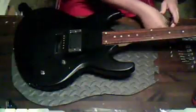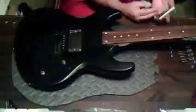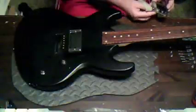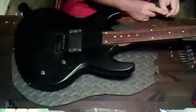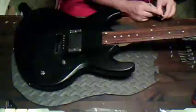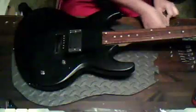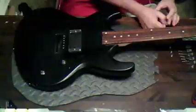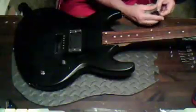A little bit rusty on the edge corner here. I don't want to take any Scotch-Brite to that because that's the highly polished side, whereas this side isn't. So I might have to take a little bit of steel wool. Sometimes if you just take your thumbnail, because the rust can't be that deep, if it's just surface rust, more times than not you can rub the rust right off, and it's coming off. Of course, I cut my thumbnails this past weekend, so I don't have much of a thumbnail. But it's working. I'm muddling through it.